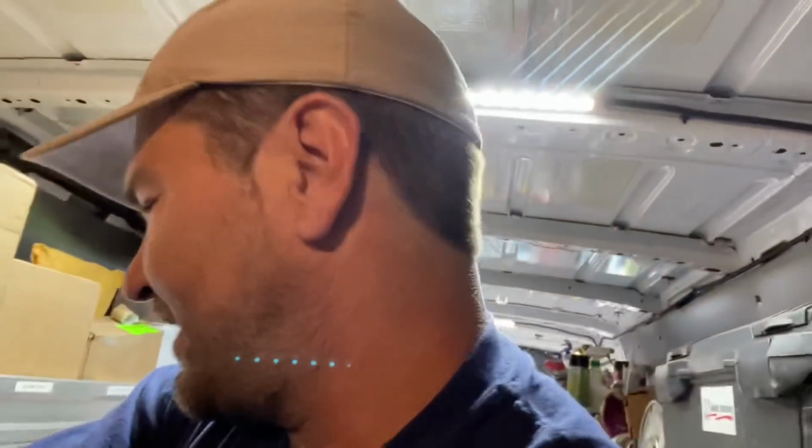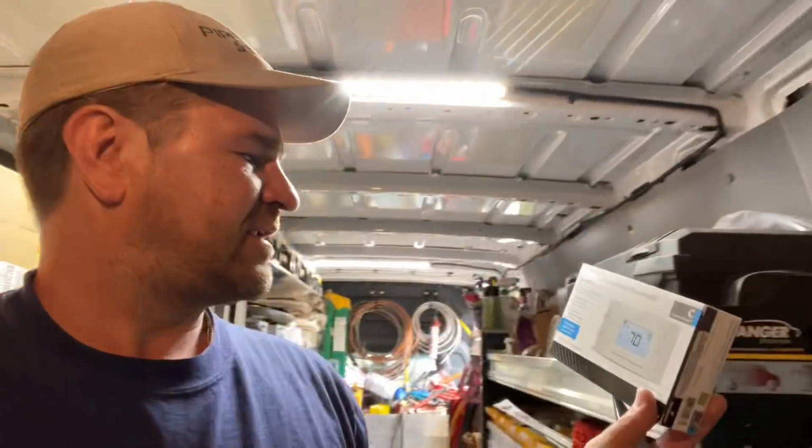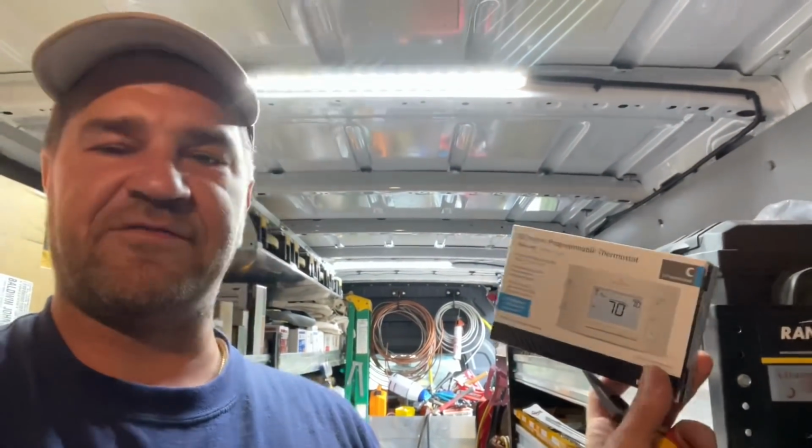You get what you pay for. You go to Home Depot, you buy these little Honeywell specials for $20, $25. You get what you pay for. So I'm going to put in two of our private label White-Rodgers Series 80. This is the 1F83C-11PR. It's got my name and phone number on it.